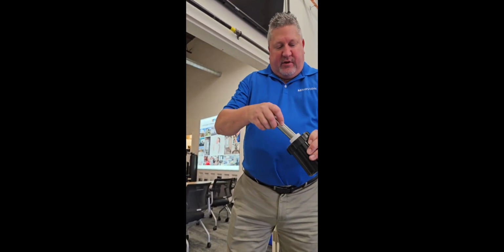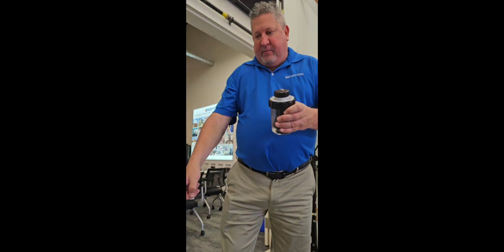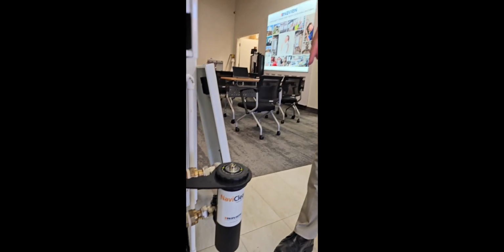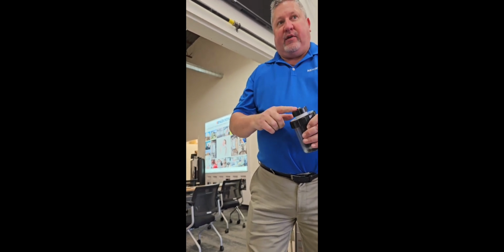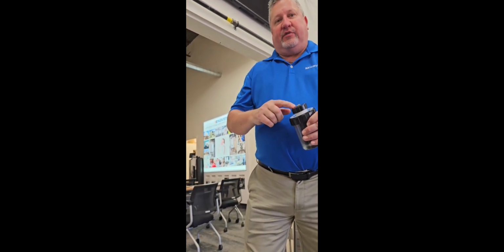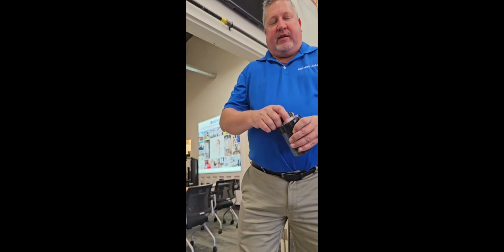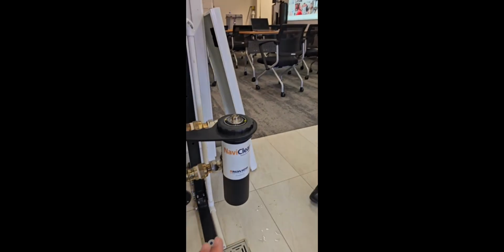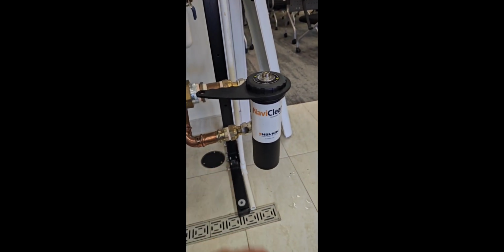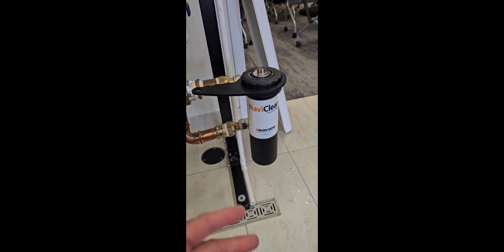So what happens is the water's flowing back into the boiler. Any of the particles, like in this, will be pulled out, and they will be gripped onto by a magnetic rod that goes down the center of the unit. That rod will have to be cleaned on a regular basis. Not only does this protect the boiler itself, but any of the new ECM style of pumps, the new high efficiency pumps, all have magnets in them. They don't like the magnetite in the system either, so this will ensure that they have a long life as well. Now you recommend to put one of these on every single install because you never know what's in the system, and it's basically like putting an air filter in front of a furnace.